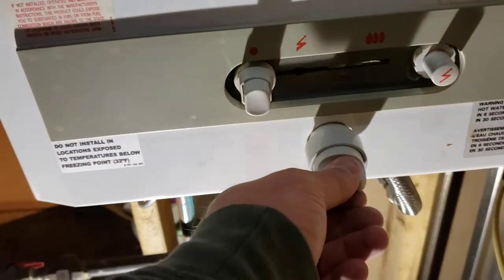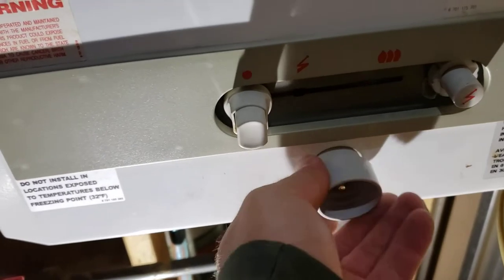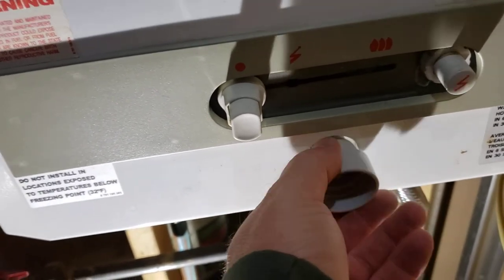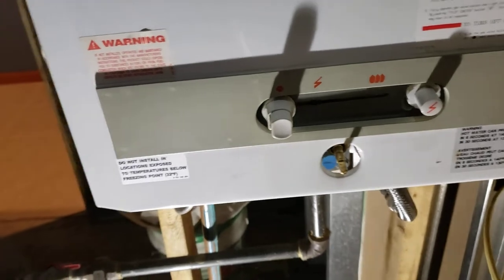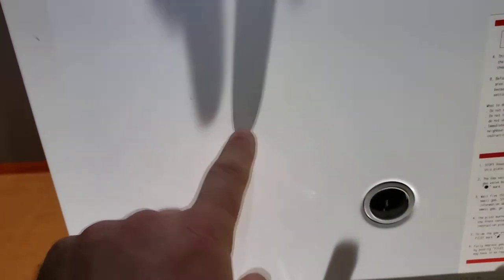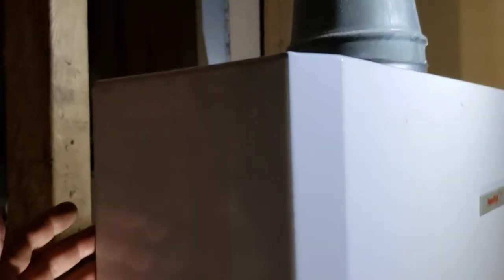What we're going to do here is pull off this temperature adjustment knob and unscrew this little piece that holds the bottom part of this metal piece intact. Then we have to take this metal shield, go up about a half inch, and pull that off. If you look at the top here and come down to about that position, there's a little metal catch — that's where it gets held on both the right and left side. I'm going to pop this off and show you what that looks like.